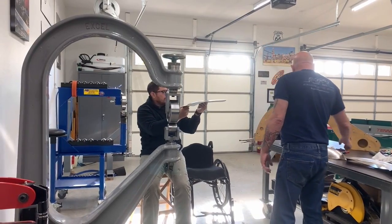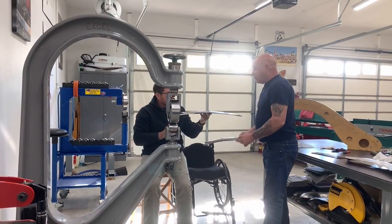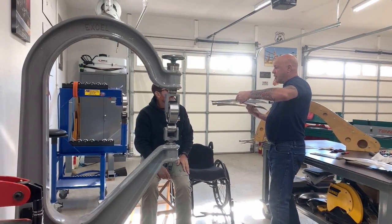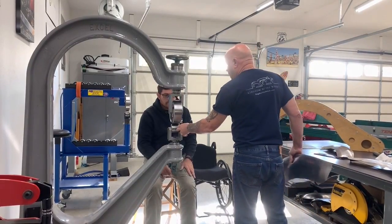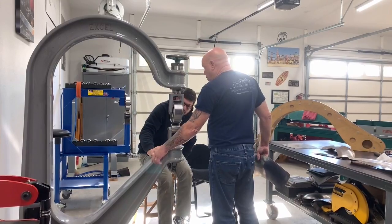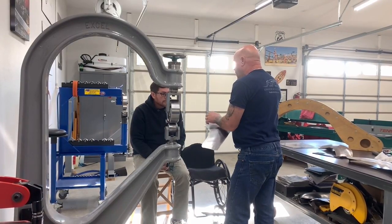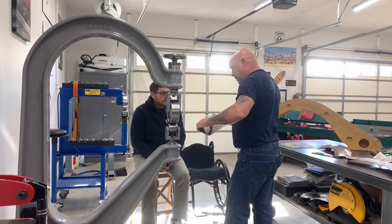So what we're looking for is for your panel to start looking like this one. As you can see, there's quite a bit of difference in crown. Because this wheel has a large flat top, and the other wheel is still quite a large flat, we're going to jump over onto the Mittler Bros wheel, and the flat tops on there are a little bit less wide. So you'll be able to put shape in a lot more.